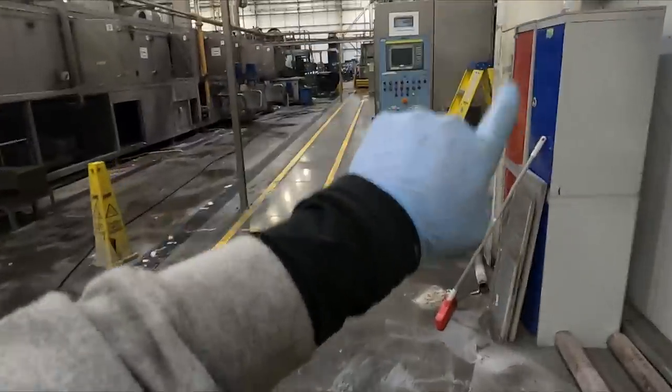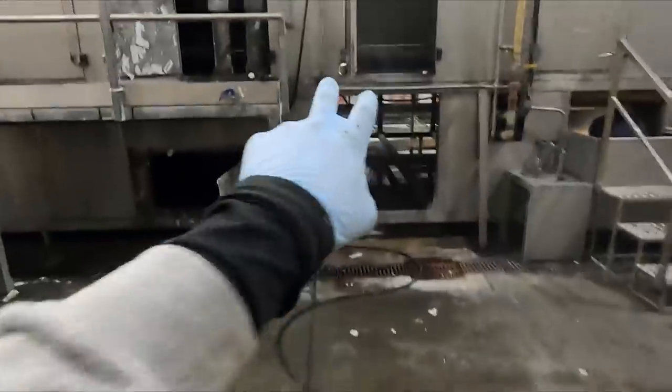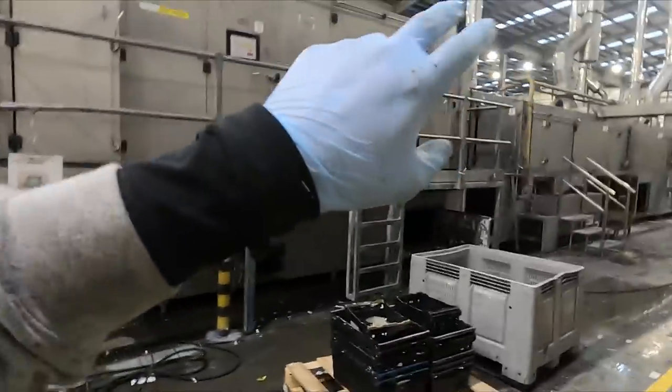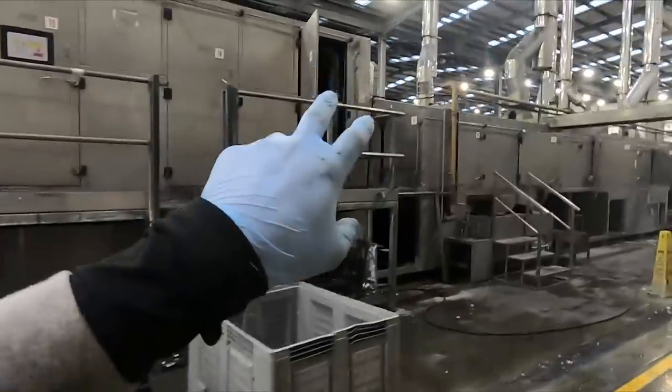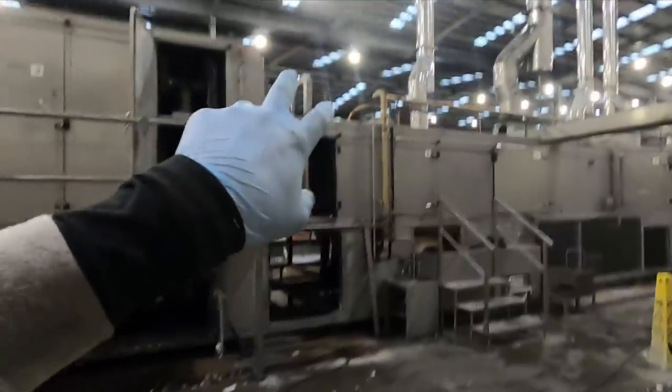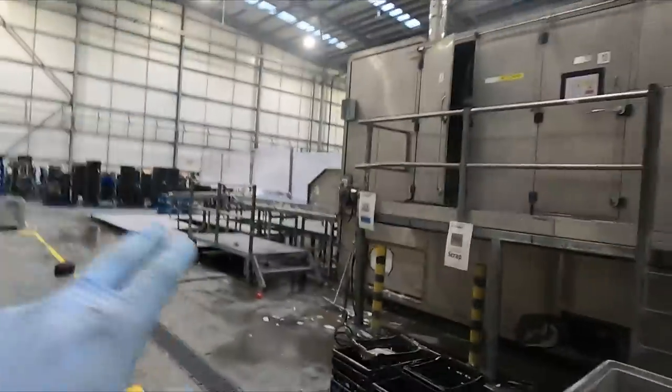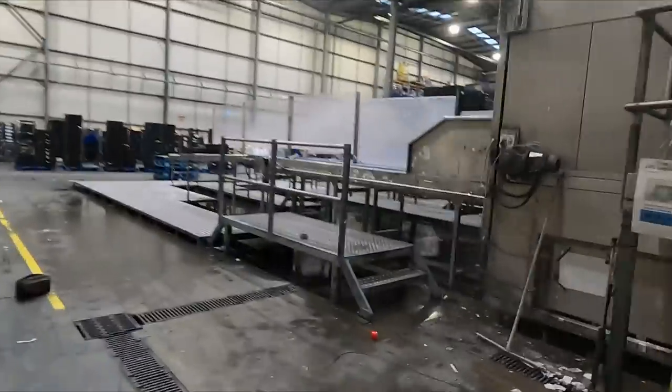Right, so that's us all done for day one. What we've done today is we've got 2 7-core cables from the BMS panel around this trunk into one actuator here, and then another actuator here. We then got 4 7-core cables from the EPO junction box, which is just on that trunk in before that 90. And we've got them to each end of each run.